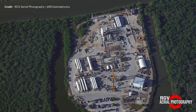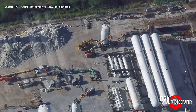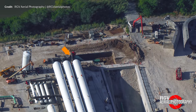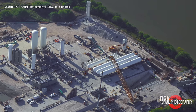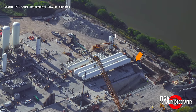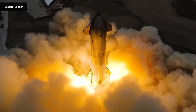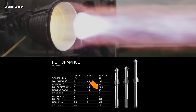Heading over to the Massey's test site, there is just so much to cover here. The ship engine testing pad looks really different to what it did a few weeks ago. The main flame trench has been pretty much dug out completely and the pipework leading towards the water-cooled flame deflector is being laid down. We can already see the pipework being fed in from the exhaust side of the trench. Just like the launch site's deluge plate system, this design seems to be made up of two separate pipes — most likely one for the center part of the deflector and the other divided and fed into the two side parts. It's critical to have a super robust flame trench when the Starship has another three vacuum engines included.